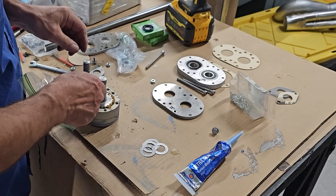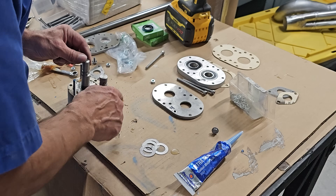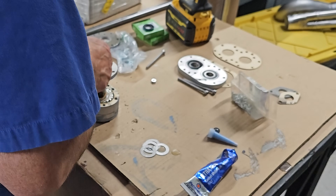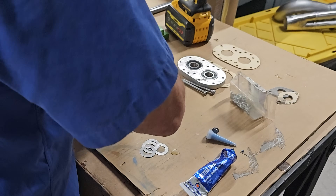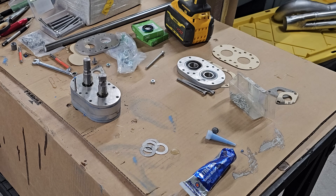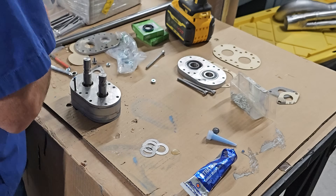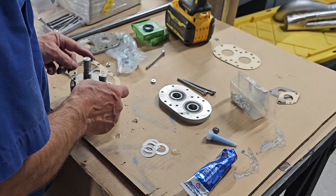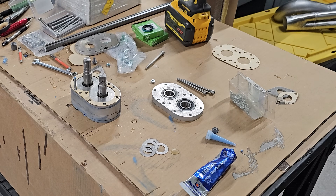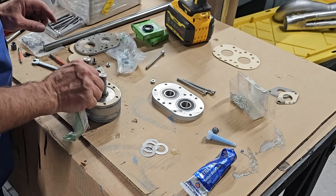With this thing loaded up, I just put some grease into a little ziplock, cut the corner off, and I'm using that to inject grease around these gears. Keep squeezing it in, pressing it in with my fingers until we have eliminated any air pockets in there. Keep this thing tight and full of grease — it'll keep any kind of water intrusion from coming in as well, if anything gets past our silicone and gasket seals. This last plate, of course, has some overly large holes that the shafts can travel right through. Put a little grease around that as well — pack every little space with grease, keep any air and water out.